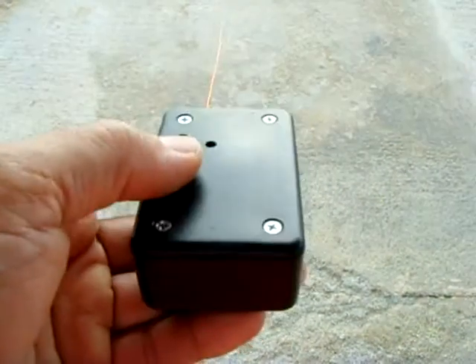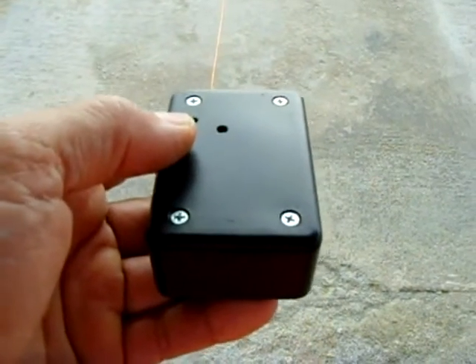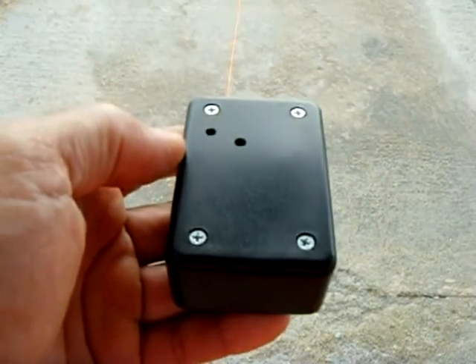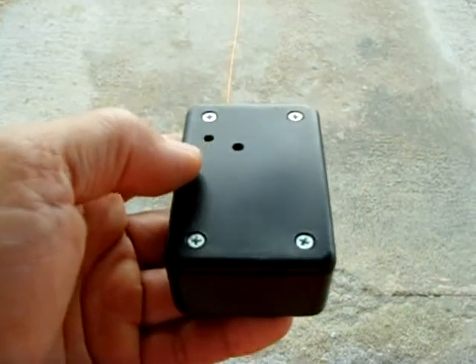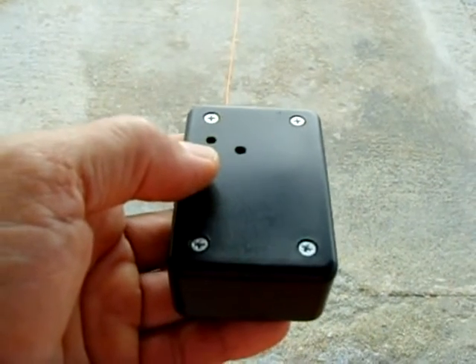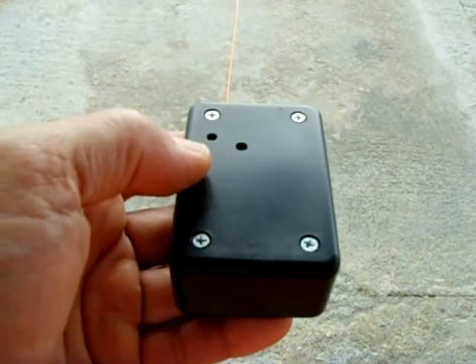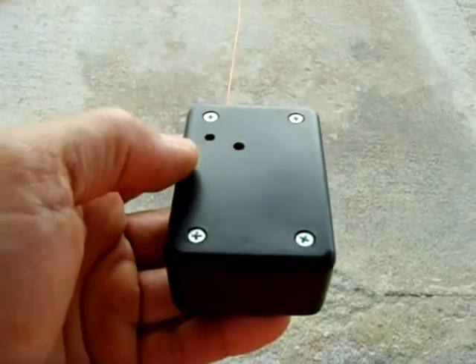In order to make this, you need a high frequency, low noise NPN transistor. I was able to find one out of an old UHF amplifier. The transistor I used was a 2SC3558, and it's good for 7 GHz.